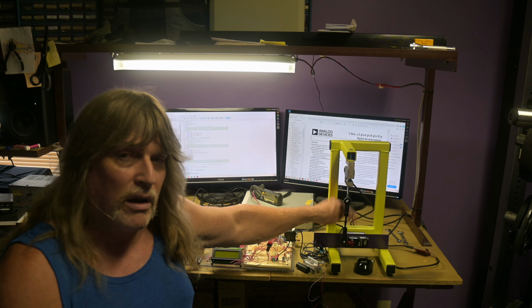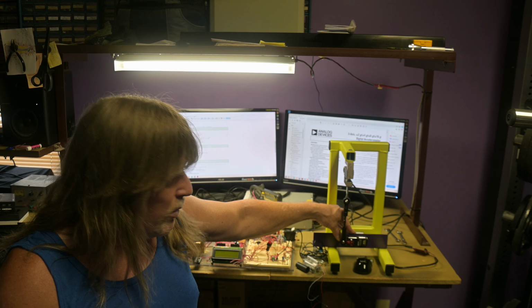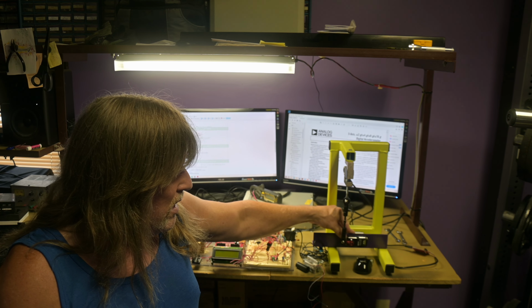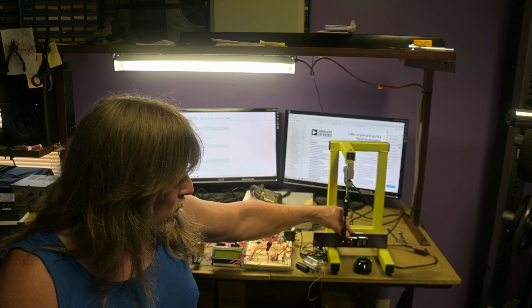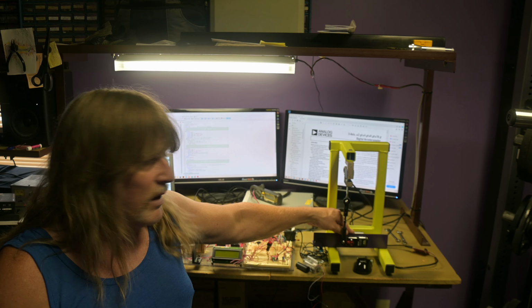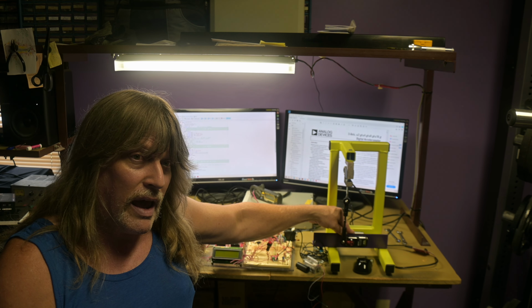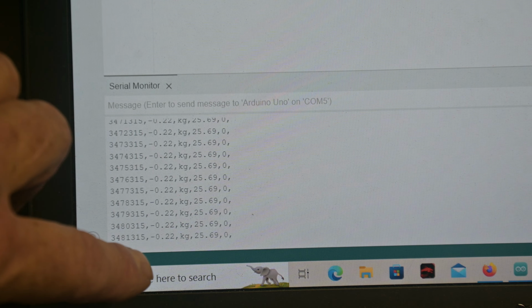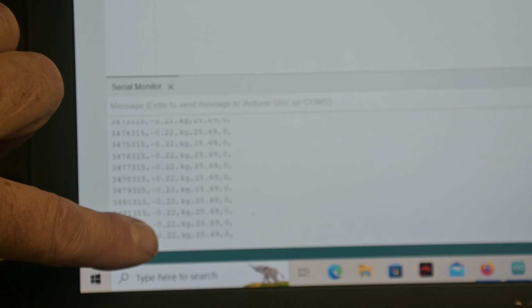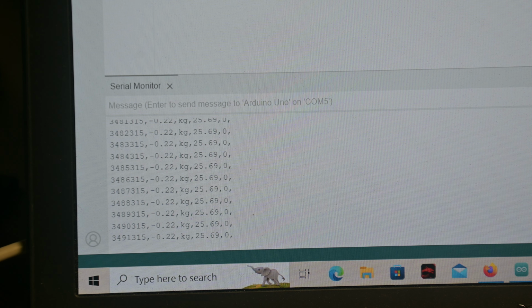So the servo I got here today is this 100 kilogram per centimeter AGFRC, and I got it set up right now with the same 1.2 inch servo horn. So we're going to see what kind of torque it comes up with at this point, and then we'll see how that relates to what I find on the Kraken when you check the steering load on that. So like before, watch that count right there in front of the kg. That'll be our load. I have an amp clamp over there on the power supply. I am running off of technically a 30 amp supply, so it's got plenty of current.